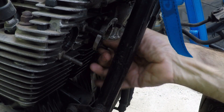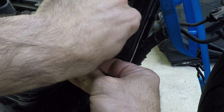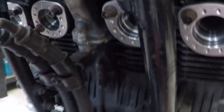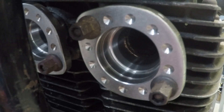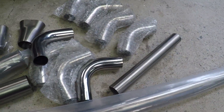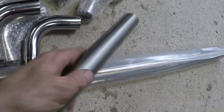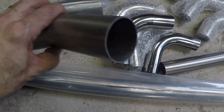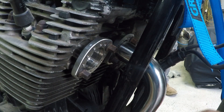Next I bolt these onto the engine. The old gasket is already compressed so I just nip these up — that's the spot they'll end up. Once these are in I can slip the 90-degree bends in. Here they are — super happy with that. The external flanges look awesome too; it'll be a smooth finish and the tube tapers down a little to match the port. Here are all the bends I bought — I was able to get 90-degree bends polished, and 60-degree ones too. I couldn't find polished inch-and-a-half tube, and there's a merge collector I'm not that impressed with that I'll do some rework on.